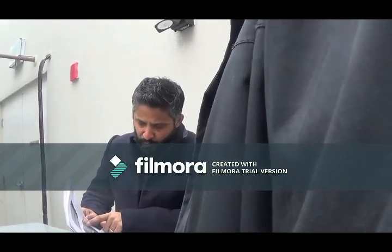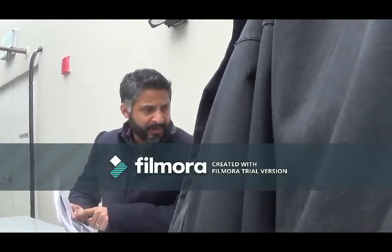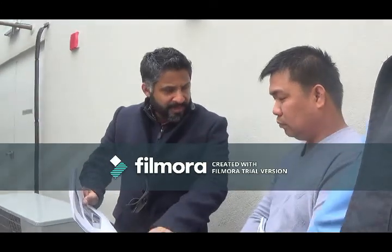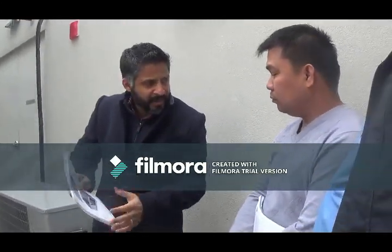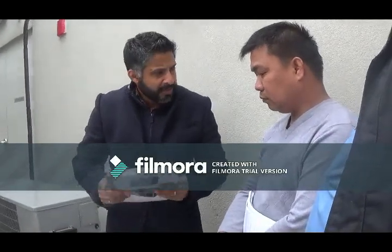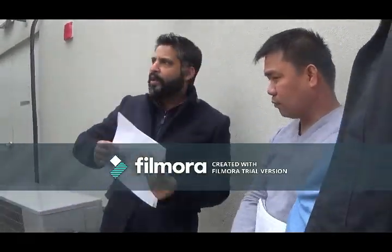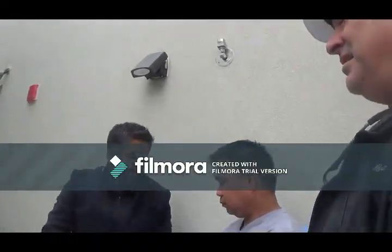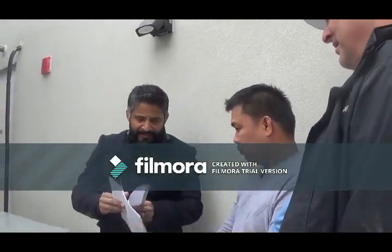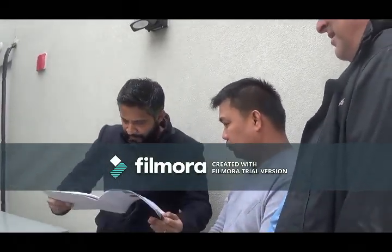Well, you see these are doors here, right, with handles. That's basically what this is. So if you were to open those little wing nuts, you can lift the doors up, and you'll see a bunch of nozzles there. Those nozzles need to be cleaned periodically as well, because whatever water you're dumping into the tower, if it has scale, dust, all of that stuff, it'll start filling up, and that nozzle eventually gets clogged, and you'll see leaks coming from the top of the tower. Then you know that is the reason why you need to do that.